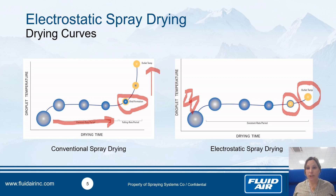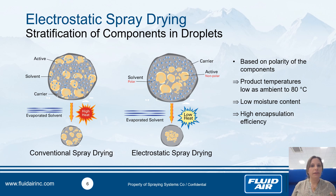This provides great protection for sensitive compounds, with no denaturation or degradation. We also choose to use nitrogen to avoid oxidation of the product. Going further, since we play on the polarity of compounds, we can also achieve stratification. In the case of non-polar oil, it's easy to encapsulate because the carrier chosen is slightly more polar — this creates a large quantity of carrier acting like a coating around the oil. This gives a really high encapsulation efficiency compared to a homogeneous repartition between your carrier, matrix, and oil where oil appears at the surface and can evaporate. The same principle applies to bacteria, giving you good protection and allowing you to increase the quantity of the encapsulated product.